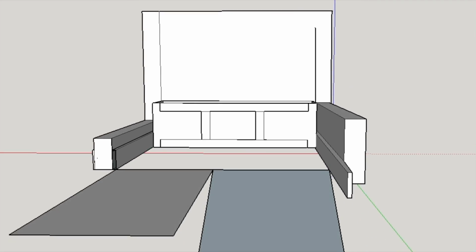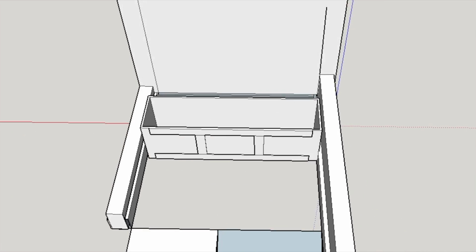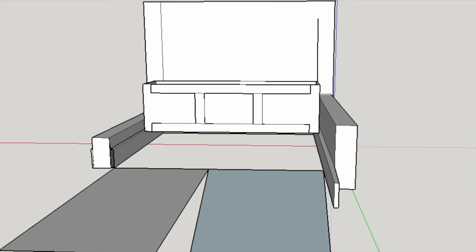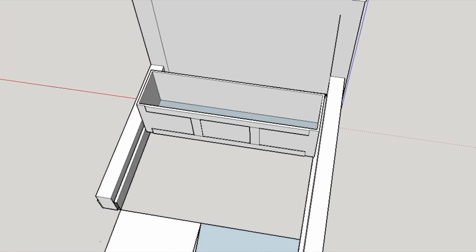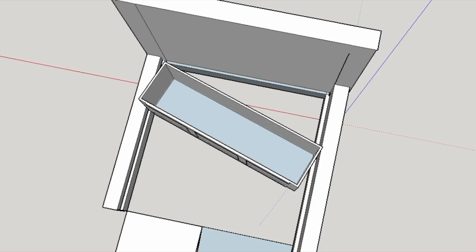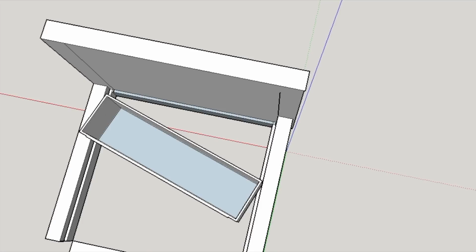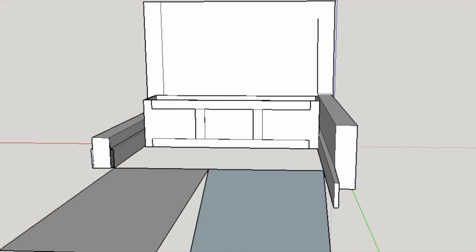Basically, for the window seat to come in, it doesn't just come up the stairs sideways and slot in. You've got to bring it up and turn it around, as you've seen in the video. And it's the diagonal when you turn it that gives us the problem, obviously, because that's longer. Now, with the ½ inch or so between the baseboards and 1 inch of skirting on either side, by my calculations, that was plenty. There should be a good 5 or 6 mil spare for that diagonal between the walls.